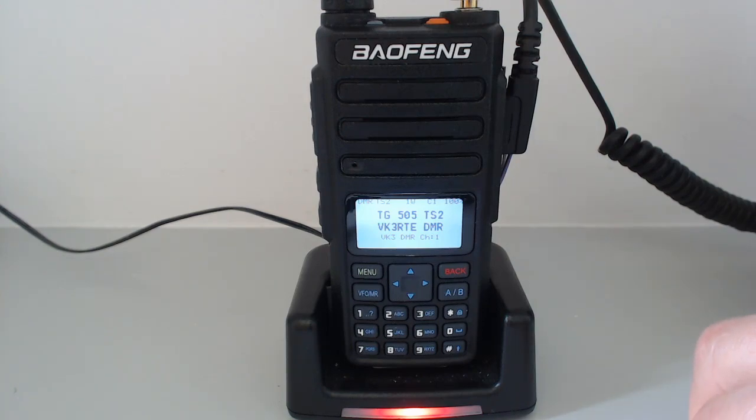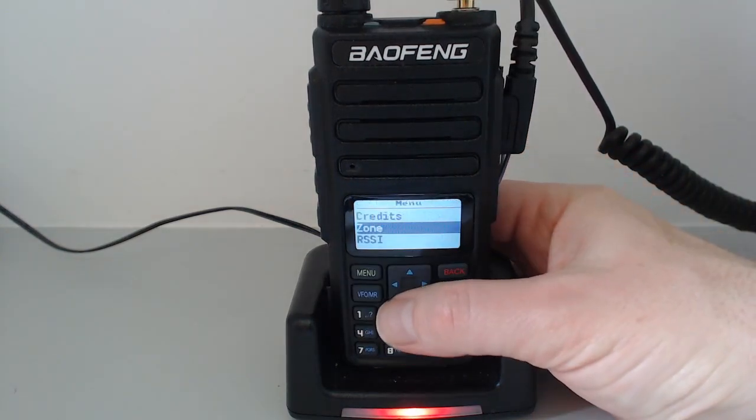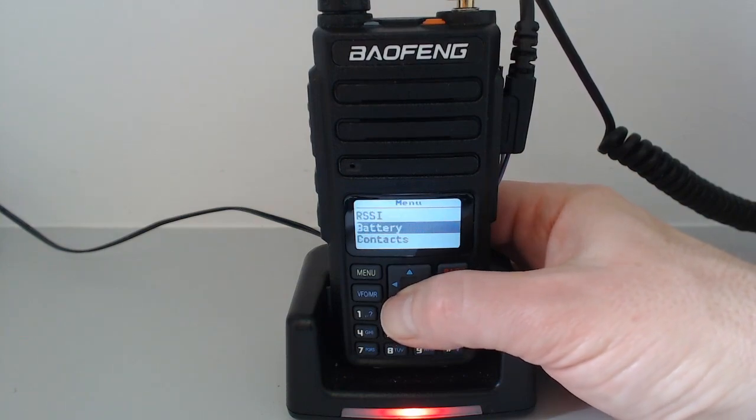It will be at the expense of making it more difficult to go back to the official firmware — you would have to back up the flash memory chip first, because otherwise you'd lose data the official firmware uses, mainly things like the font for the display. The OpenGD77 uses a font built into the firmware itself. Apart from that, generally everything is the same — all the menus are the same, really no difference.